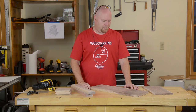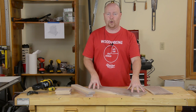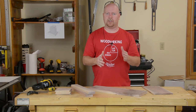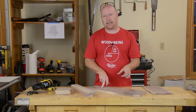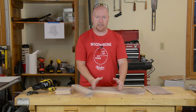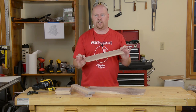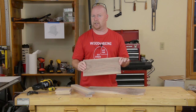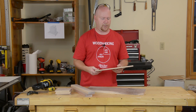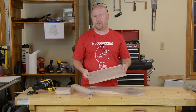Small change of plans here. I got to looking at the grain on this thicker stock, and I have enough wood to make both the base lid and the upright support out of this piece. But I don't really like the grain that I'm going to be left with if I cut that big piece out of the middle. So instead I'm going to make the top of the base out of the remainder of the thinner 3/8-inch stock. That means the base is going to be just a little bit lighter than it would have been otherwise, but it's plenty wide enough to have good stability, so I'm not too worried about it.